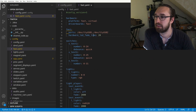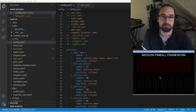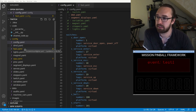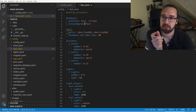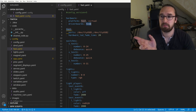Let me show how the FAST hardware is configured in MPF. I prepared a small machine config. There's a hardware file where I first configure the platform — I tell MPF the platform is 'fast.' I also have some virtual items like the DMD, so I list that, but the primary platform is fast. Then I configure the driver boards under 'fast_boards' — either 'fast' for the node boards, or 'wpc' if you have one of the WPC prototypes.